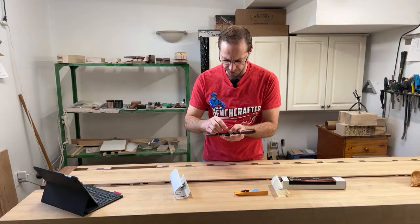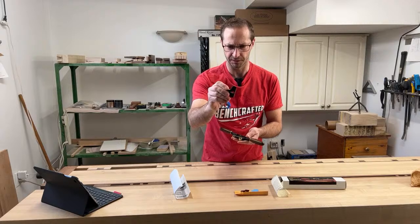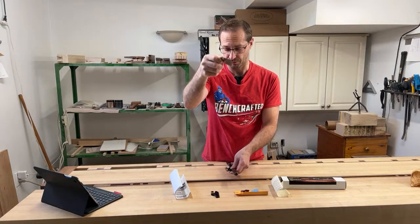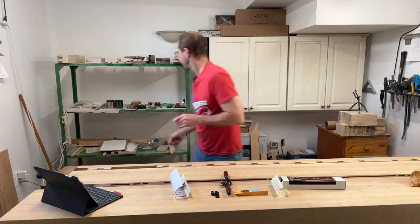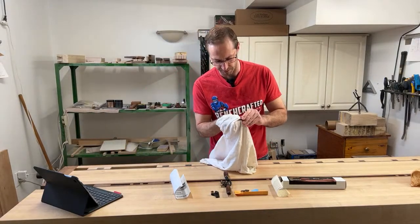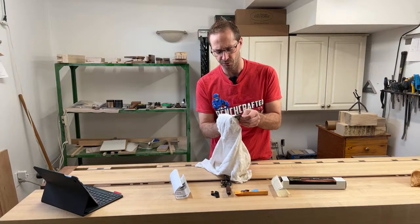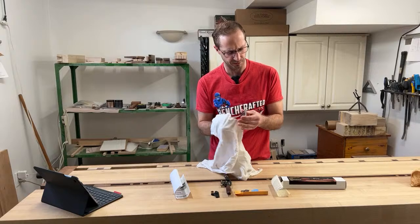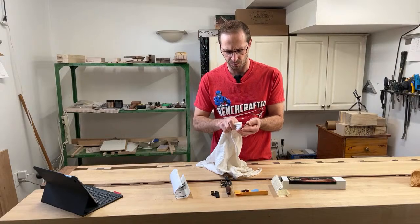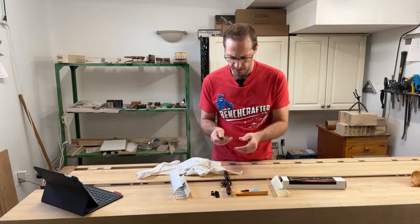I'll slip it apart here quickly just so I can give you a quick tour of the parts. Here's what would be like a lever cap, and here's the blade — it is a bevel-down spokeshave blade. There is a tiny bit of oil on it, probably to prevent rust, and it does look like there is a micro bevel at the edge. It's PMV-11 tool steel for the blade. I don't think they make it in any other tool steel — when I bought it at Lee Valley on Friday there were no options to pick any other blade steel.